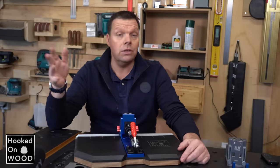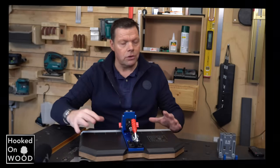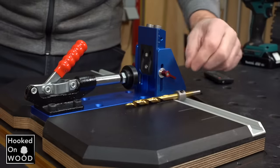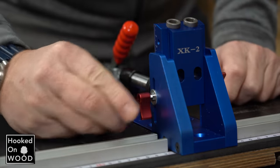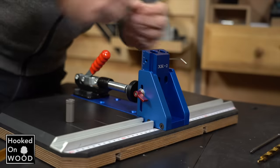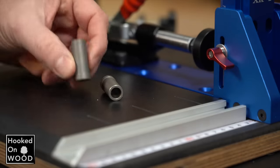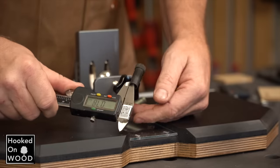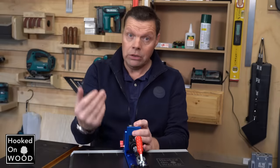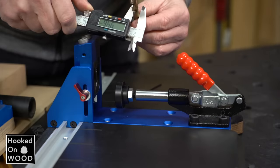During the upload of this video it is on sale for $69, and you can find a discount code in the video description to get it for even $64. The packaging is perfect. The drill bit and the screwdriver are both very straight. The knobs to adjust the height look nicely finished and of good quality. The drill guides are made from hardened steel and are very thick — measuring 2.2 millimeters. Comparing that to the orange pocket hole jig bushings, we clearly see the difference in quality. These bushings are not only made from better material but are also three times thicker. The drill bit fits very tight and there is very little play. It feels really confident.